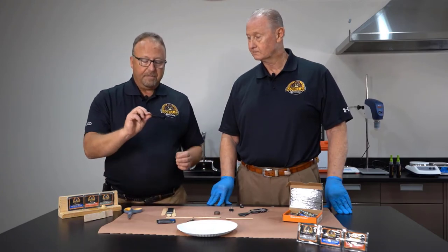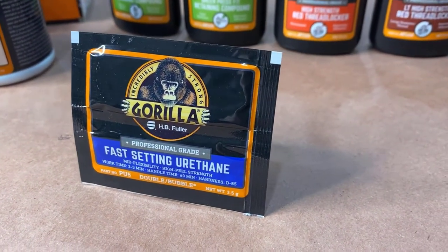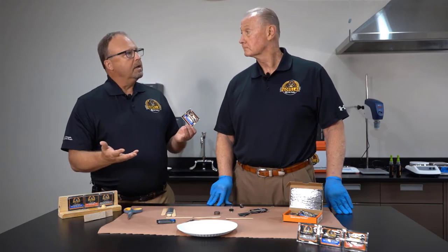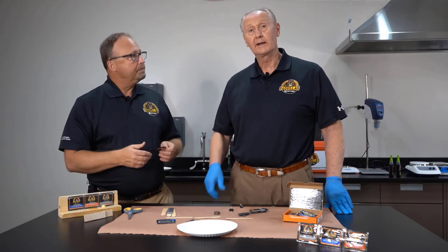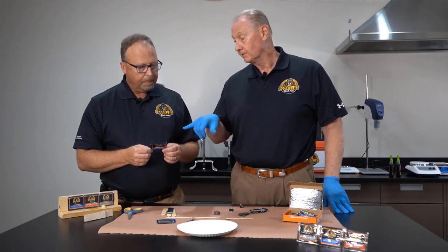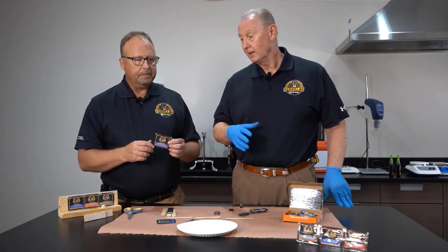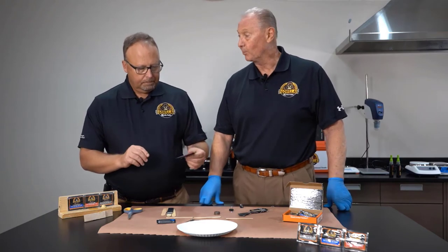We also have our fast-setting urethane epoxy. This one is most commonly used in applications where you have movable products like leathers, rubber, plastic — anything that's going to have a lot of movability, or most importantly, dissimilar materials where one expansion rate is different than the other. You might need some flexibility between a rigid substrate and a softer material. The urethanes give you that added flexibility. They also bond hard-to-bond thermoplastics like TPO and urethane that most epoxies will not bond. So it's a nice addition to the portfolio.